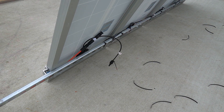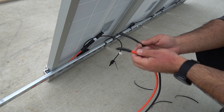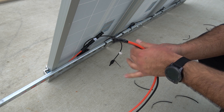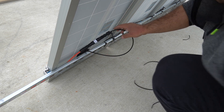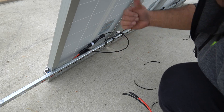At this point everything is wired and cable-managed. Because the panels are live and hot, I went ahead and taped off the ends that are going into the charge controller just to prevent anyone from getting shocked. There is a fuse in here that came with the Renogy kit, and all my power is now coming out of these two lines. Let me manage that last cable and then we're going to throw this on the roof.